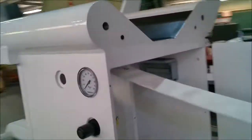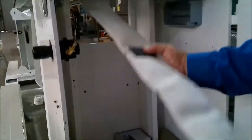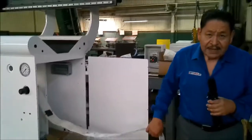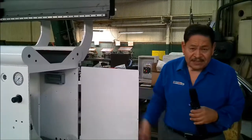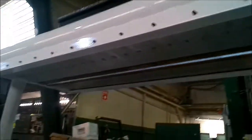So what I'm doing is pulling the hose through — you can see our clamp assembly is right here. You would now remove the clamp assembly, remove your aluminum plug that's on the end of your old hose, and transplant that onto the new one and you're done. In an hour you can do the job that it would take you two days to do if you had to replace all the fingers. We're actually fishing right through that channel without having to disassemble anything.